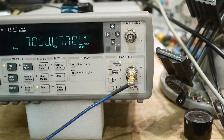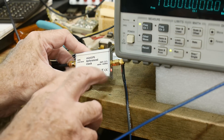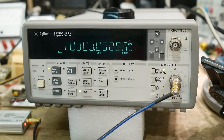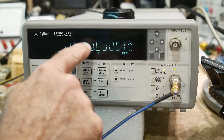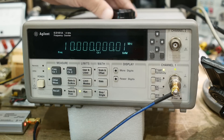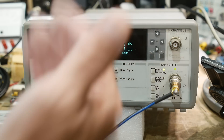This counter is working really well and so is my reference clock. The GPS reference clock — I did a video on that, it's a mini GPS reference clock, you can find it in my playlist. It was donated by a viewer, very nice. So it's coming in handy today. We are measuring 10 digits and they are dithering right there at the very last digit. We should be able to look at some of the other counters and see if they also just dither at the last digit. My complaint with the Racal Dana was I seemed to be getting some noise on that last digit and I wasn't sure if it was real or whether the generator was sick. This one seems to check out.